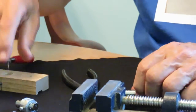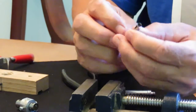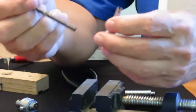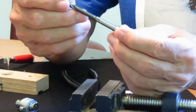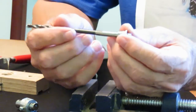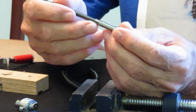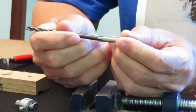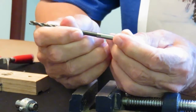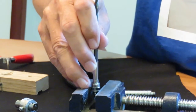Now that we have that apart, here's your chimney. This is where the 13/64 drill bit comes in handy. What you want to do is take the drill bit in, and there is a pin in there, a center post. It's your positive. It's also part of your air intake. Just give it a little push down in. It should drop about 3/16, maybe an eighth at best.